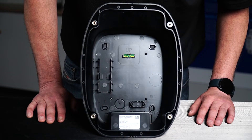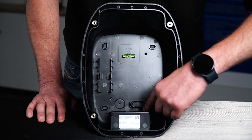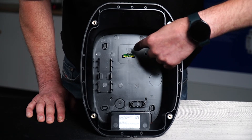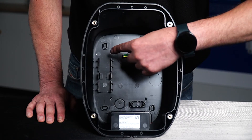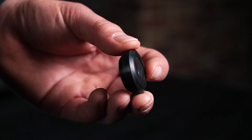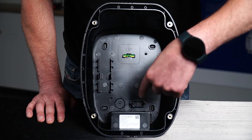With the front cover removed you can now see the pre-drilled 25mm supply cable hole, the stand for the cable grip, the embedded spirit level, the fixing position and clamp to the incoming power connector. There is also a 25mm drill out point when supplying the charger from the rear — please ensure to use the supplied 25mm grommet when using this form of entry. And the four fixing points for mounting the enclosure to the wall.